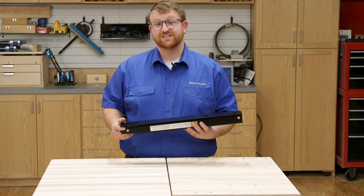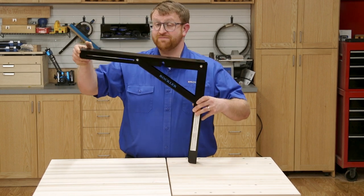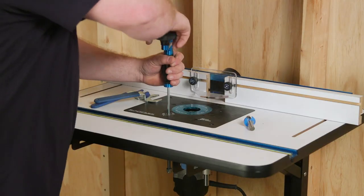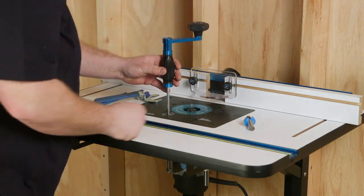And like the previous two folding legs I've showed you, these brackets are heavy duty. One pair of these brackets holds up to 500 pounds and you can install the brackets up to 32 inches apart to create a fold-down worktop up to 24 inches deep and 40 inches wide.